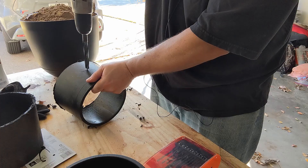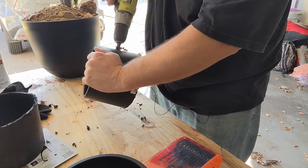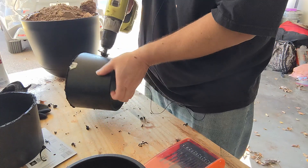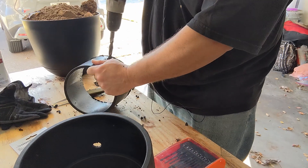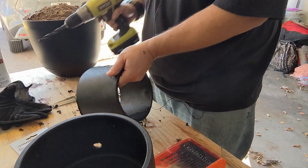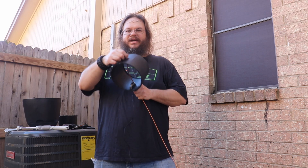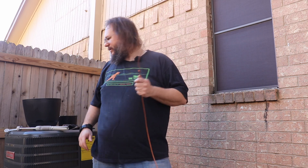One down. Two down. Now that we got the holes drilled, let's go ahead and continue running the wire. I'm going to run the wire through one hole, then attach the locking lug to the grounding rod, and then out the other side. Since it's all on one continuous strand, I don't have to cut it and put it back together.